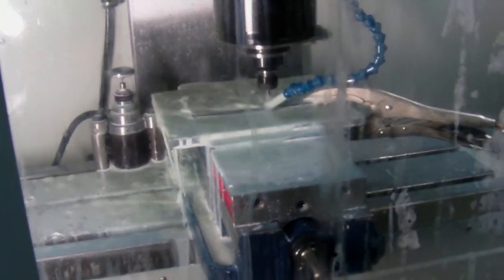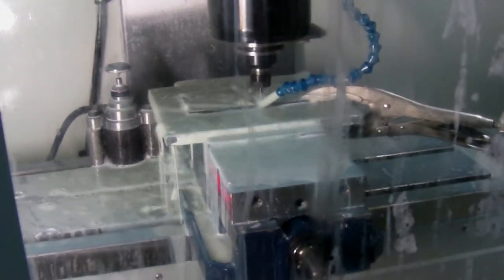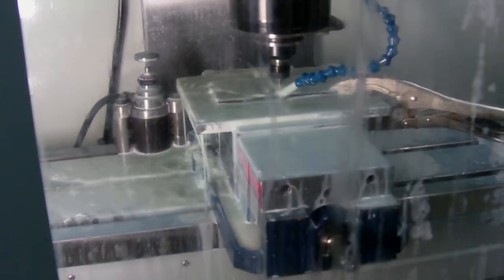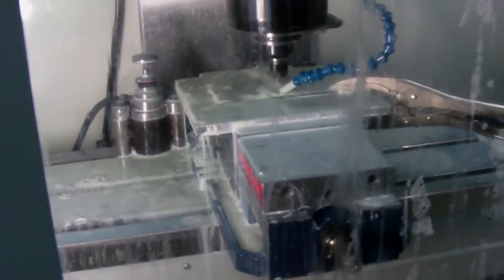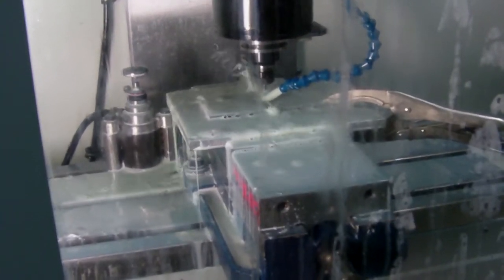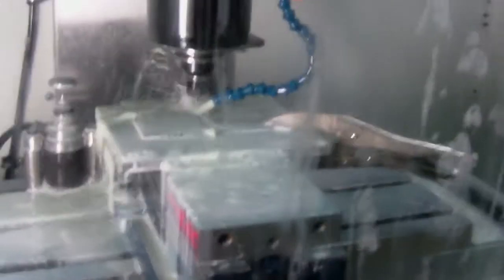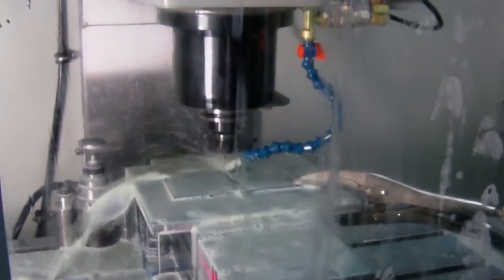So that's detached now? Not yet. Almost. After it goes back up there and the top comes up, it'll be. I'll stop it real quick and just take it out, and then you can look at it. If I had a smaller cobalt 4 flute, I would probably have run it instead of the carbide. It's up 30 there. Roughing it, we could have done it with 2 cuts easily. Alright, see what happens here.